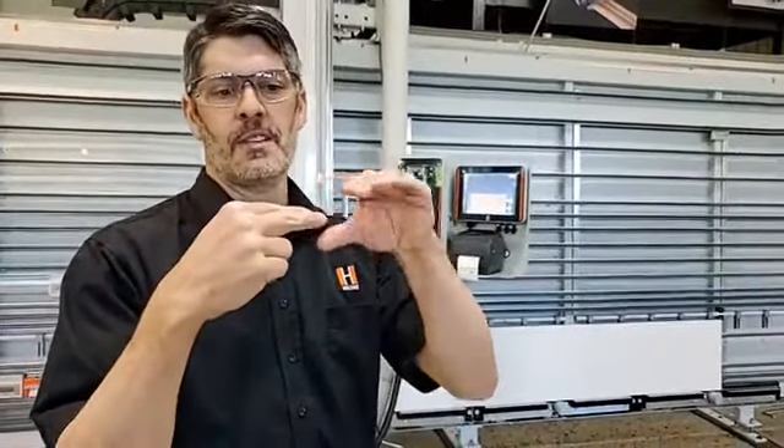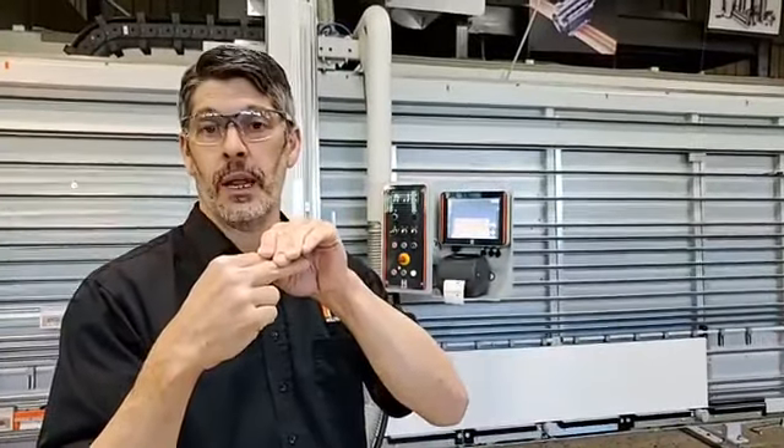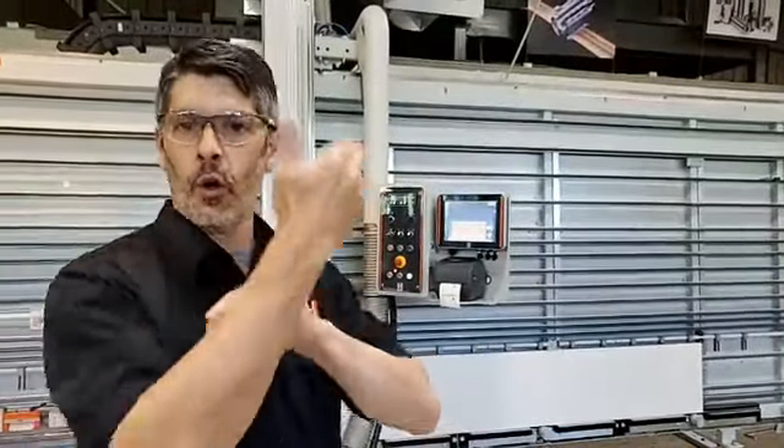Does the saw blade never bind when you're making the cut? No, there's actually a riving knife behind the blade — a thin blade the same as the kerf. This prevents the board from collapsing onto the blade from the back side, or even in vertical from the board compressing. Therefore we don't bind.